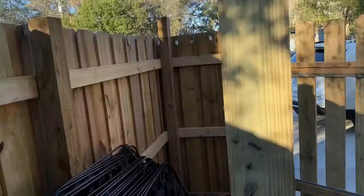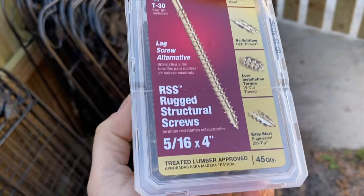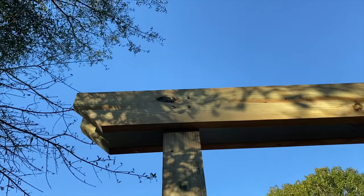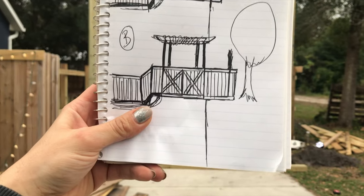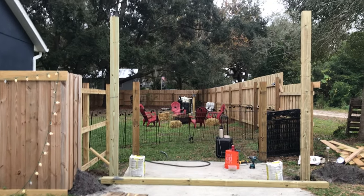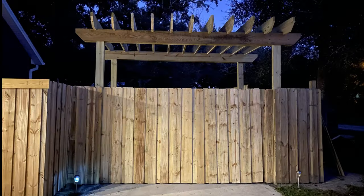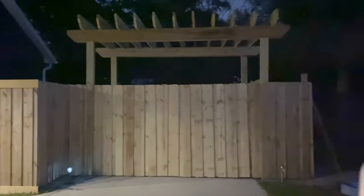With the posts, we're attaching the structural beams to the posts with lag bolts — putting four on each side. So here's our original drawing, our original plan, and kind of what we started with — and what it looks like now. This one was pretty difficult but it was fun, and it really adds so much. We still have a little bit of trim to do — we're going to trim the top out like that other part of the fence. Thank you so much for watching — please like and subscribe, see you next time.